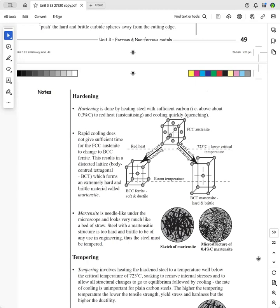And so I used to get that same mold blade that was wholly martensitic, and I used to temper it. Now, tempering replaces brittleness with toughness. And the way that you temper it is you heat it up to a temperature well below the critical temperature, well below red heat, and then you allow it to cool in air. And the way the blacksmiths do it, they harden the metal, and then they just get a wire brush and bring up the shininess of the metal, and then they reheat it, and the oxide that's formed on the shiny part of the metal changes color with temperature. And these are called temper colors. If you want to have a look at it, go to YouTube and just see what temper colors are. It's worthwhile doing that so that you remember it.